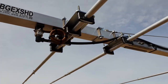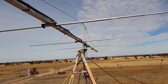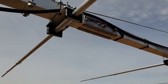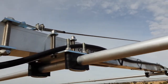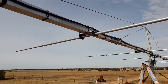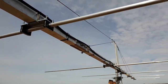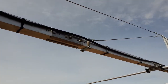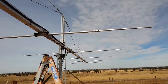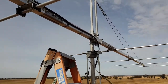I've run a patch cable out — I've got quite a few 7/16th DIN cables but no really long ones. This gets to the middle and then I'll just adapt off an end connector. The guy wires are stainless steel and there are four of them on the antenna. These are some of the boom join plates — pretty impressive construction. I've had it on the test stand here for a while and it's been through some wind with no dramas.